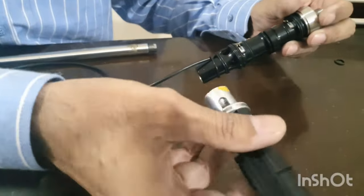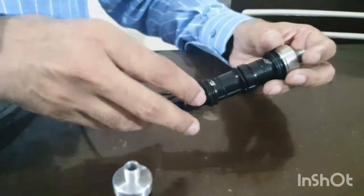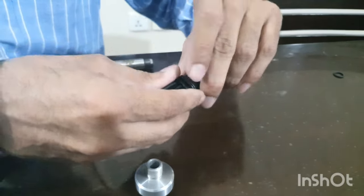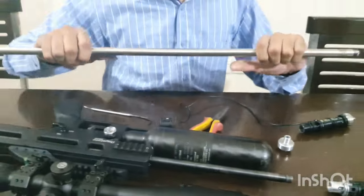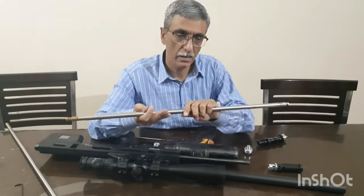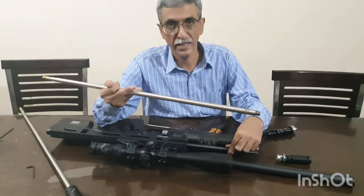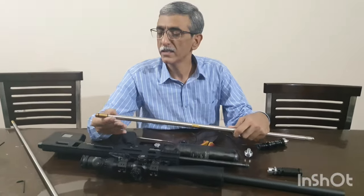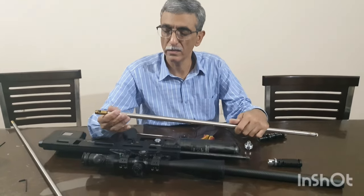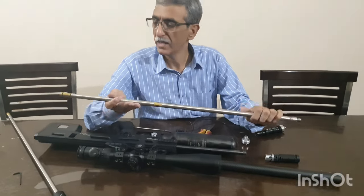just like I had made these bigger holes, right? So approximately the same volume of air now goes backwards to the shroud, right? So what we finally did after installing my barrel here, we found this stainless steel pipe. The outer diameter is 15 mm, as its original barrel is 15 mm, right? And this is the impact style, this transfer port and this retaining nut, right? Inside there is a 700 mm liner.